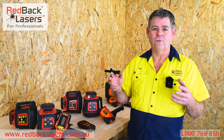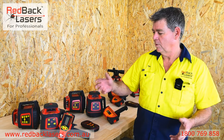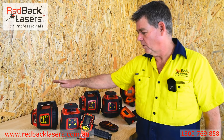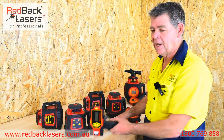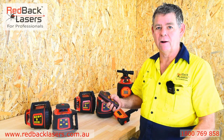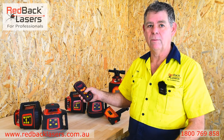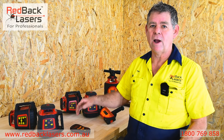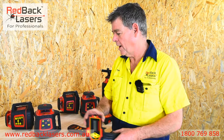So you're a plumber and you're looking around for a grade laser. We'll start off with the EL614S and the EGL624. Those lasers come with the standard receiver. We can set our receiver at our required height and then, using the remote control, match that laser off to the receiver to get our grade. We can set a grade of up to 10% in the X or Y axis.